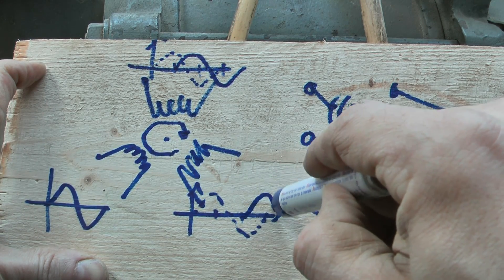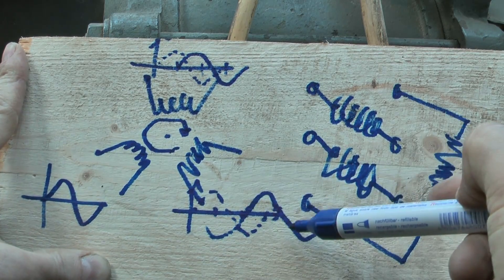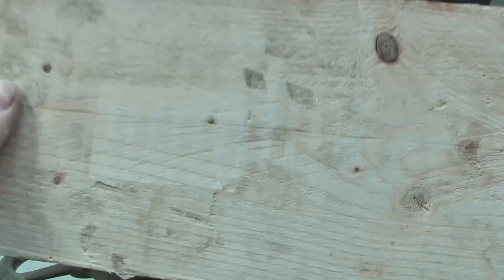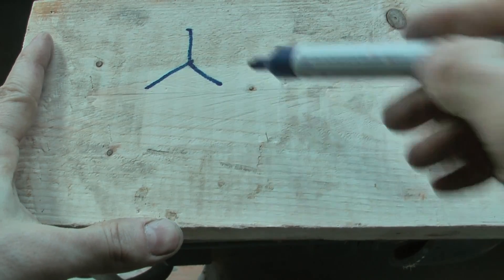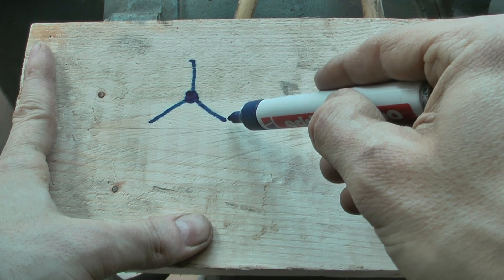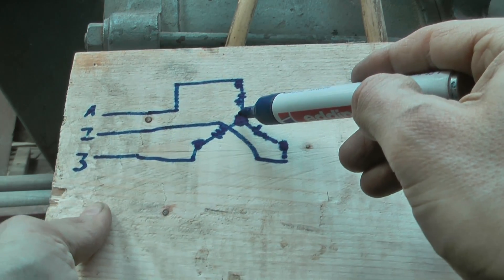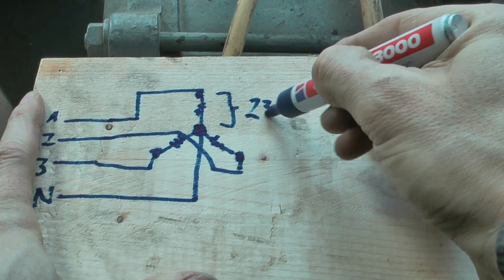So we've got to put it here, and then the next thing would be going here again with a delay of one third — and that's exactly the same shape where we started. So this is what makes the induction motor turn. These motors can be wired in two different ways. There is one standard way called star, where one part of each of the three circuits is connected together, and the other end is put to three different phases of the incoming AC. The inner point is a neutral, so every circuit gets 230 volts.